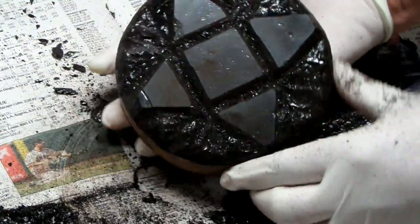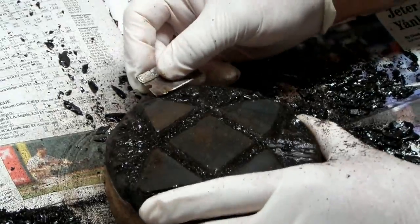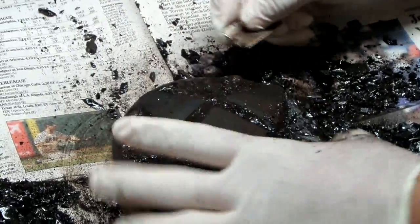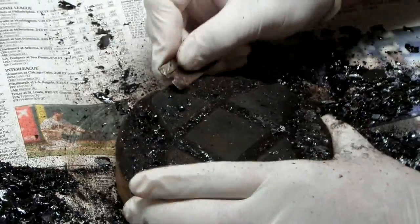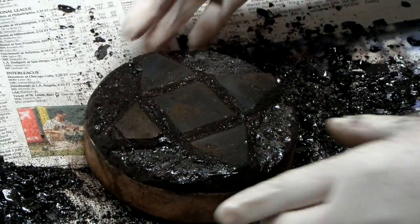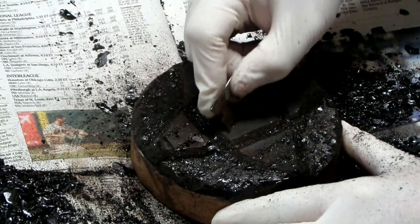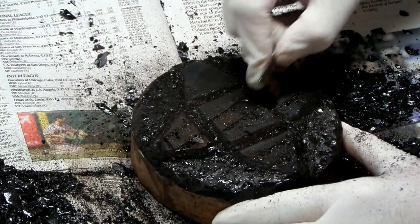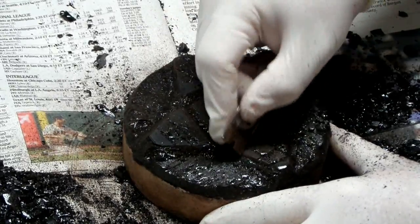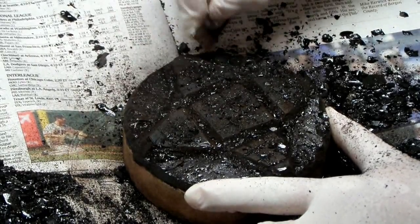Now you can see this polisher is kind of star-shaped with big chunks missing. I usually like to clean it up a little bit, so I run the razor blade over the flat areas to cleanse the surface. Then I like to micro-facet the polisher with the razor blade by cutting some tiny channels across it — basically just scratching through the surface, not going very deep at all, way less than a millimeter. Rotate it 90 degrees and put another set in. The spacing doesn't matter, just as long as there's some depth to them.